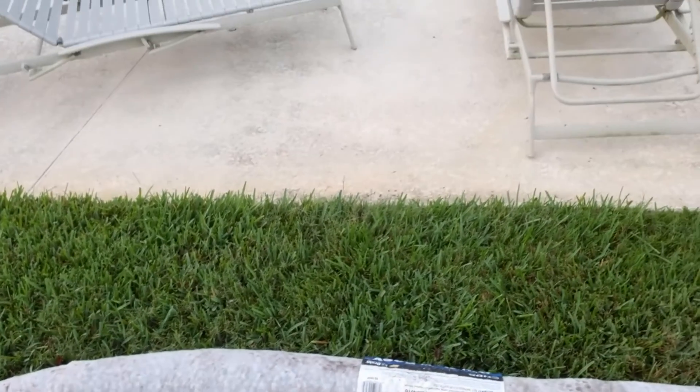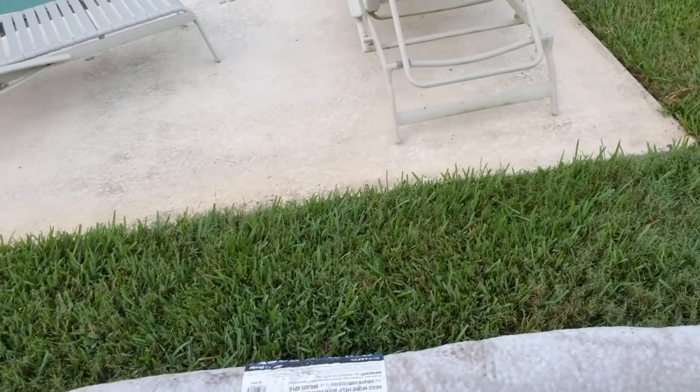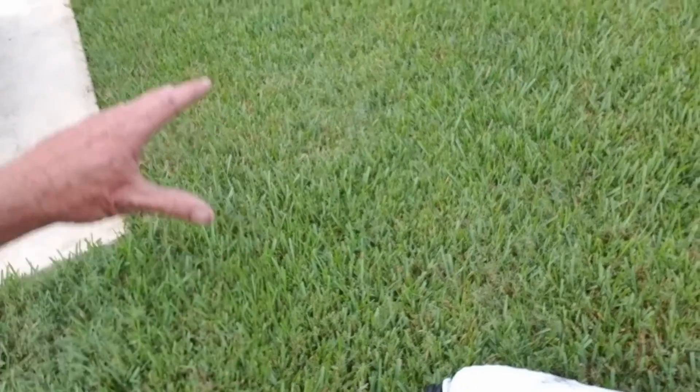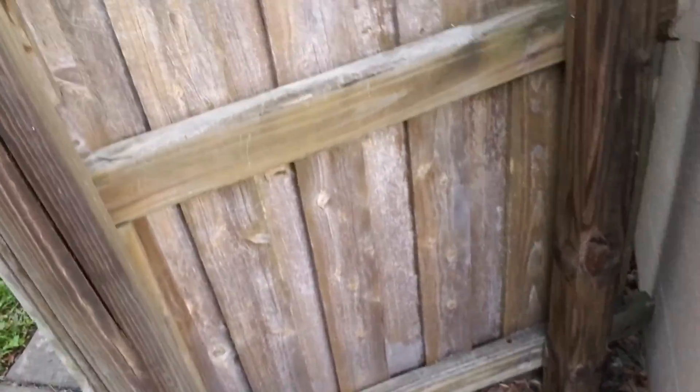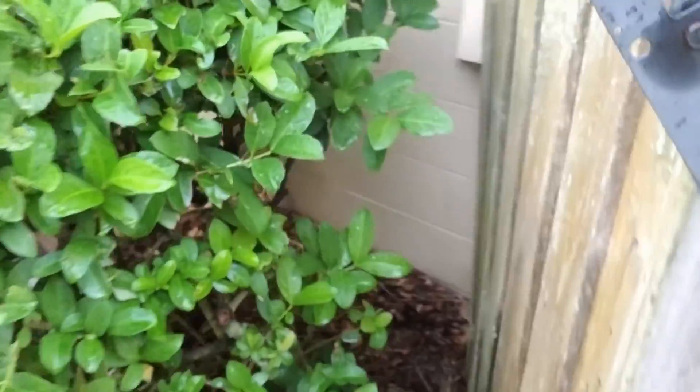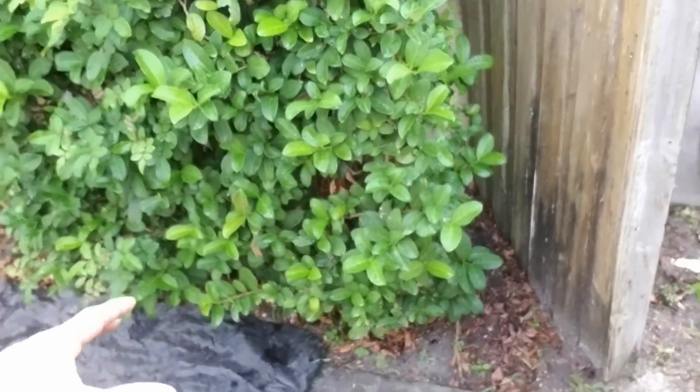This acts as a French drain. It's going to collect the groundwater — as the groundwater rises, it comes up into that system and is carried away. We'll also put a couple of catch basins out here to pick up the surface water. As surface water comes across the ground, it drops into the system. From here it goes under the sidewalk, and we're going to have to put a sump pump in. We're going to pull up these viburnums, and the sump pump's going to go right there.